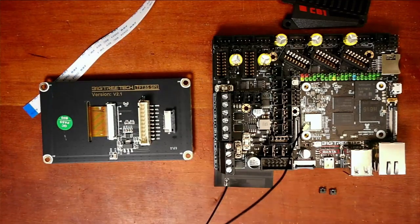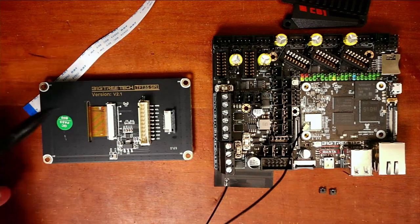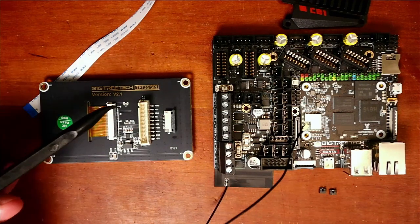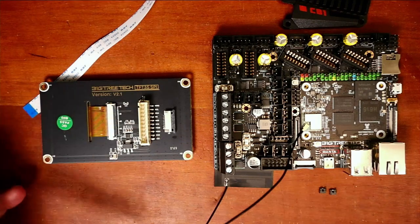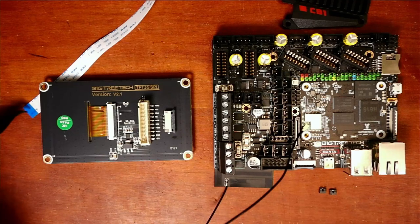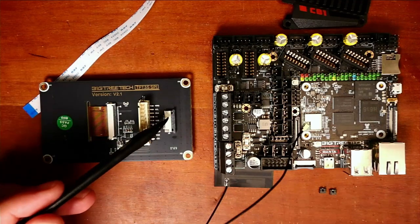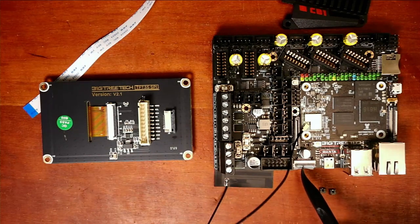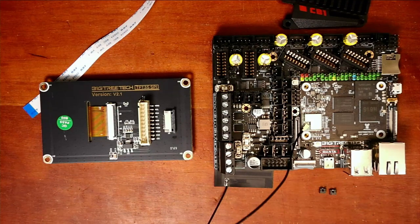So as you can see, there's a couple of different connectors. This one actually connects to the components that are on the board underneath. This connector we're not going to use, and this is our SPI connector. So we're going to actually use this ribbon cable to connect to it via the ZIF socket, I believe it's called. And then we have another one right over here that's on the board. Now this was kind of difficult to find the information in the manual on this, but I eventually did find it because it didn't talk about it almost at all.